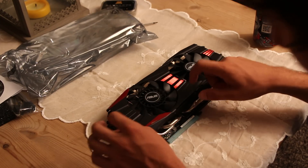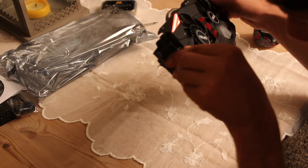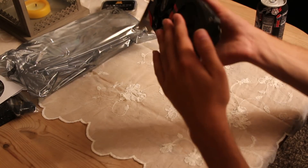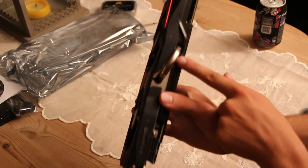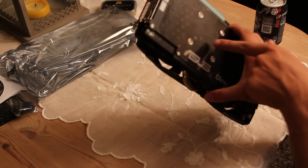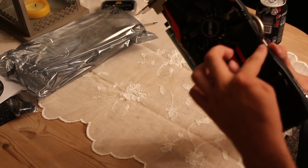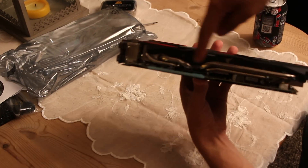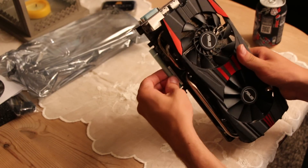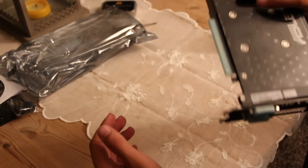The shroud on top is actually metal, which is pretty cool. The fans are plastic, and the massive heatsink is made of aluminum with copper heat pipes — there's a massive 10mm heat pipe right here. It runs from the GPU core, transferring heat over to this section of the heatsink, with more heat pipes continuing to transfer heat away from the GPU. It also has protective covers over the PCI slot contacts.